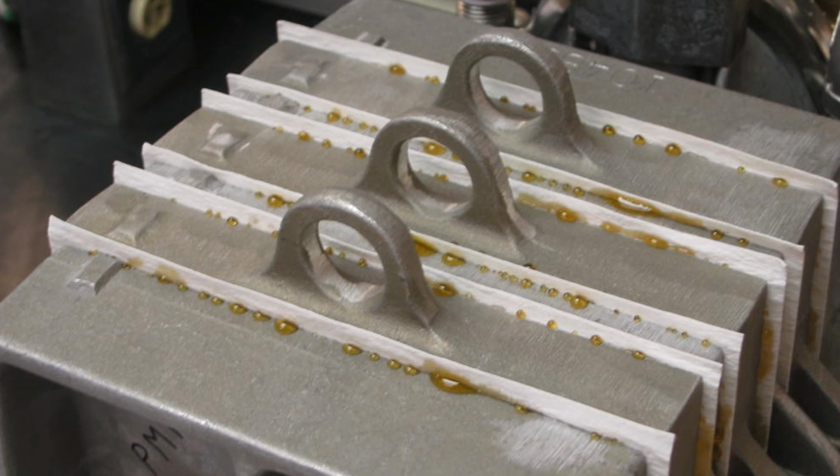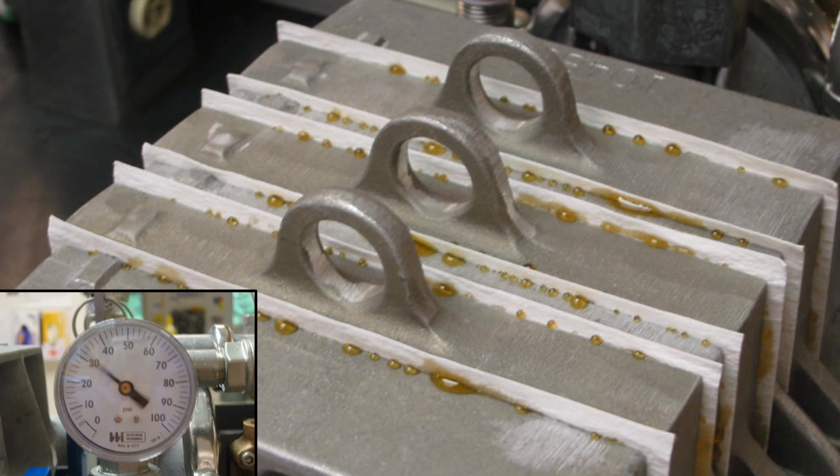So the way to anticipate or to shut down before you have a problem, you want to have an eye on the pressure gauge. Filter presses will come with a pressure gauge. Generally speaking, when you're running the press, there won't be hardly any pressure developed in that press at all. When you start to see pressure building, what that means is that setup is starting to clog. And you really need to be careful and keep an eye on it, not ignore it anymore.